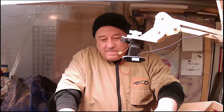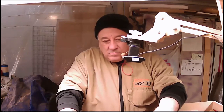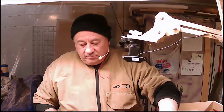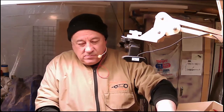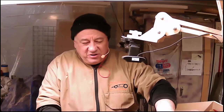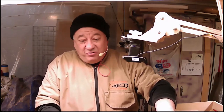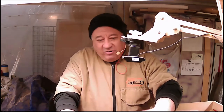Yes, you can move it back and forth — the teeth stay in the grooves. That's the beauty of it: once you've done it a few times, you know how deep you wish to go by what you're looking at. Running at 500 RPMs keeps it slow so you can see what's happening to the spirals. It does take a little bit of practice and a light touch, but the short answer is: if you go too fast and push too hard, you're just going to tear up the wood. The tool knows what it's supposed to do — just let it do it.